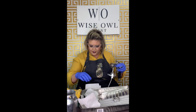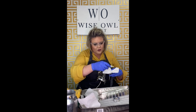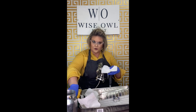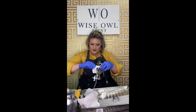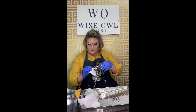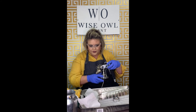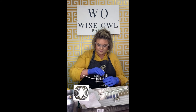After you replace your air nozzle, you're going to want to take that same paper towel, maybe a drop or two more. You actually can just put one drop on the threads where the air cap's gonna go, especially since we cleaned with solvent. This area, you want to make sure you keep oiled up every so often. Okay, replace your spring.